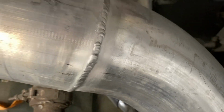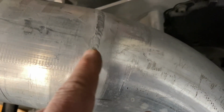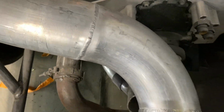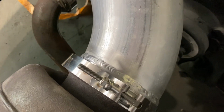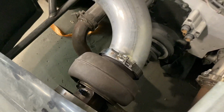So my welding on this one, moving forward, hitting it with some heat, and then dropping the rod in it, and then moving back is kind of what I'm trying to do. I don't know if that's the most accurate way or not, but it seems to work okay, reasonably decent. Got to get it nice and clean. Use a stainless steel brush when you're cleaning it, and make sure that stainless steel brush is only used for aluminum to get that oxide off, and try not to dip the tungsten in it.